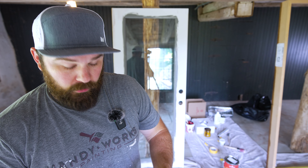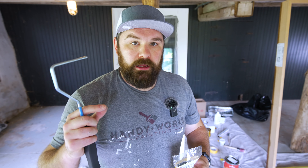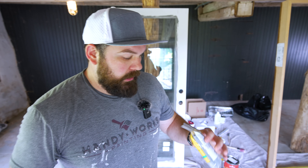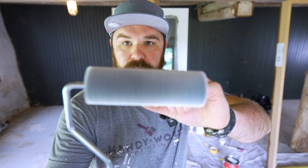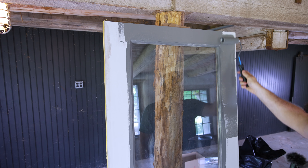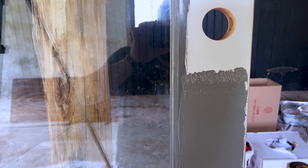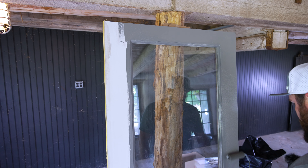The door is now ready to be rolled. For that process, I'm using a flock roller from All Pro — it's a newer product to me. It's similar to a foam roller, but it has little hairs in it that pop the bubbles often formed by foam rollers. I used one yesterday to lay down satin polyurethane on a board and it did really well, so I want to see how it does with this paint. I'm using a little mini roller frame — you can see the foam part and then the little hairy part on the outside, which aids in a super smooth finish. We're going to roll horizontally on the horizontal sections and up and down on the verticals. I'm using a tiny four-inch mini roller. The only pan I had with an insert is a 14-inch pan, which is unnecessary, but that's what I had. It's laying it down pretty good — doesn't hold a lot of paint so it goes on pretty thin, which is fine.